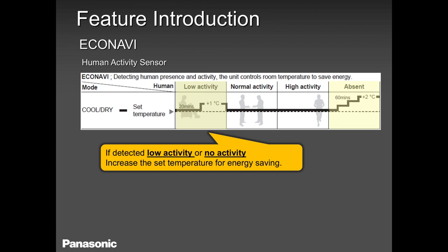Many homeowners think that a heat pump is just like a normal furnace. A normal furnace won't take long to catch up and get you to your room temperature setting, even if you put a 6, 7, 8 degree night setback. But with a heat pump, it's a lot. The heat pump gets heat from the outside. The colder it is, the longer it takes to give you heat. So please keep that in mind.